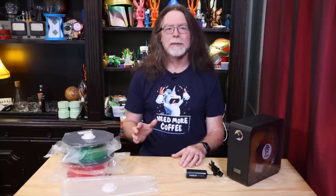That stream is definitely worth a watch, and you'll find a link to it in the description. So ideally, you'll want to run your filament through an active drying cycle as few times as possible, and then do your best to keep it dry. After drying it, keep it stored in a sealed environment with a desiccant pack — the desiccant is much more hygroscopic than the filament, and it'll absorb the moisture from the air before the filament can.